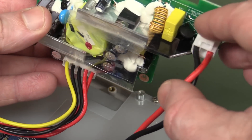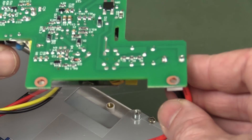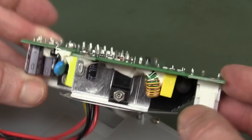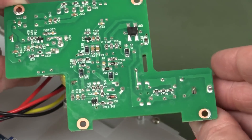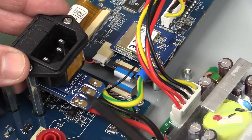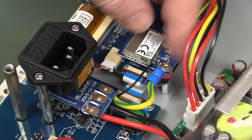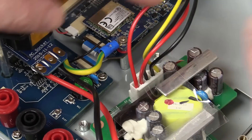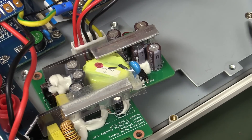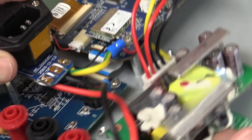There's no-name caps but that's par for the course. It all looks fairly reasonable for the price point. But there's no input fuse - they just put a link where the fuse is supposed to be. We have one thermistor and that's basically it. There's no poly protection or anything like that. We've got exposed mains wiring here, but that's all completely covered with the case. Earth going through the WiFi board all the way through to the main plate, which bolts into the BNCs.